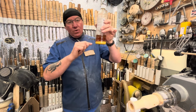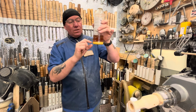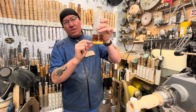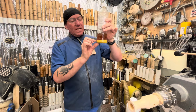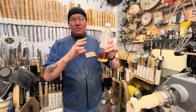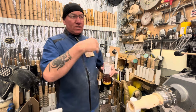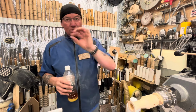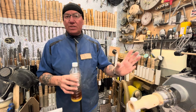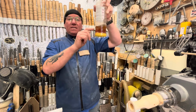Then I've got the 50 mil of that, so then I would put around 10 mil of oil. That's what I find works for this. Too much oil takes too long to dry, and it'll keep going dull. You have to keep waiting and going over it and over it, because it'll go dull, and all that is the oil coming to the top and drying. It's the oil taking its time to dry. That's basically the mix.